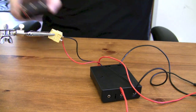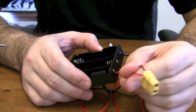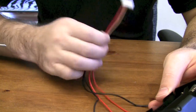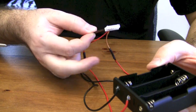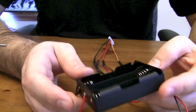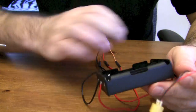Now that I've disconnected the XT60 connector from my old battery case, my new balancing charging case is ready to go. This is going to be the main connector attaching to the charger — the red and the black go to the plus and minus of the pack. Then I have the balancing cable: the black cable goes to the minus, and all subsequent cables go to the plus polarity of each module — plus here, plus here, and plus there — so that's 1S, 2S, 3S. That's how you get the 3S balancing charging port.